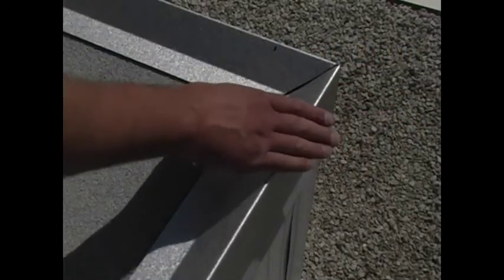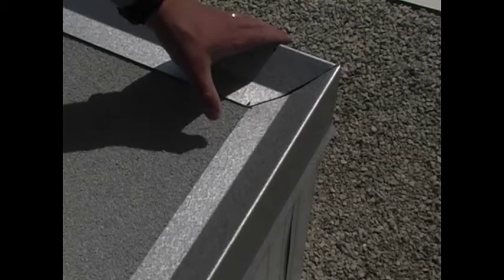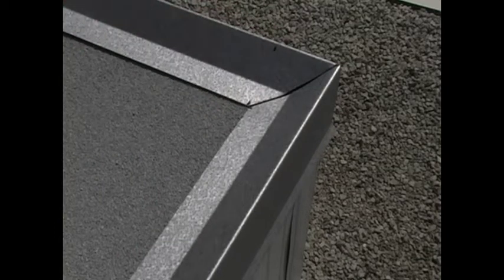When filling out an order form, right and left hand notations may need to be made. Left and right hand notations are taken from the roof area and not the ground. The roof surface should be prepared to accept the cantam. The cap sheet or roof membrane should be wrapped over the top of the nailer and secured with nails to the face every 12 inches on center.